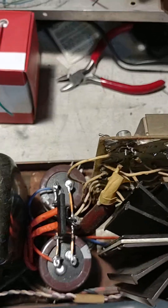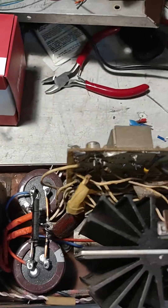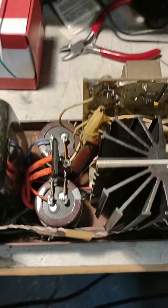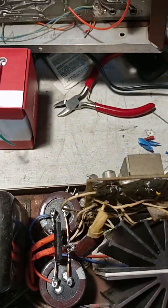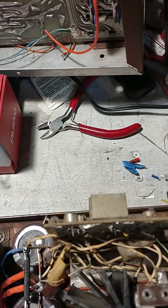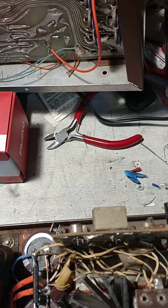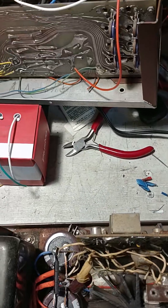It shorted and I ran it for a while. Then I felt the diodes — they don't get warm. So obviously I've lost a cap already. I'm so certain at this point I'm just going to loosen those clamps and pull the whole thing as one piece and maybe replace the cap, if everything is soldered together otherwise.